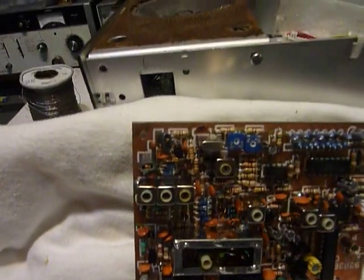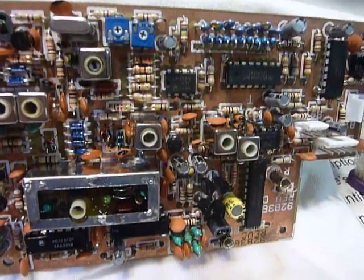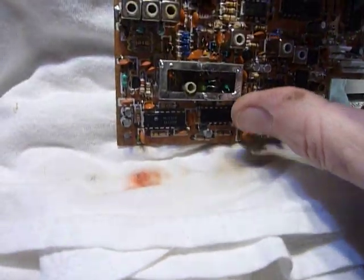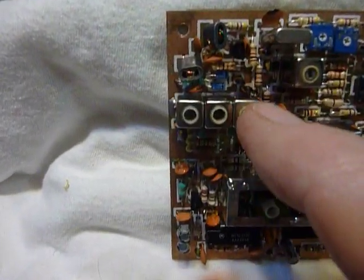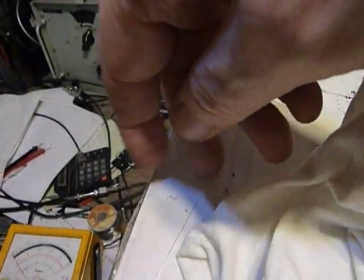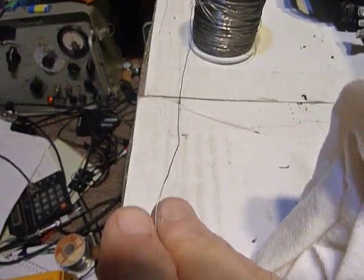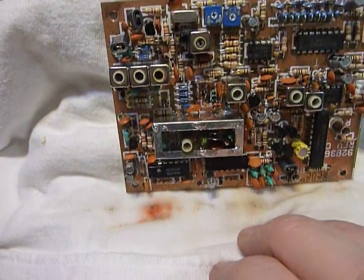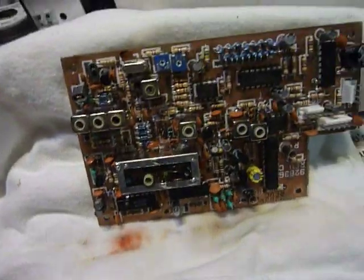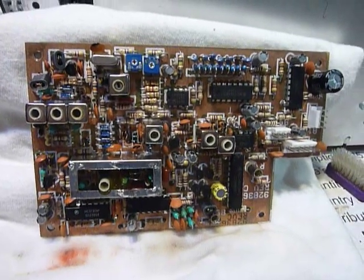So that's it. I am going to do the rest of this board too, just not right now — I'll do it after I get done with this video. I was just showing you how to clean the board. I had re-soldered all the connections underneath these little transformers using a very small soldering iron and 15-thousandth diameter solder. That solder was given to me — the people that bought it thought it was too small, but when you're working on little bitty things and just want to add a little bit of solder, it's perfect. That's part two of repairing the TenTec Omni 6 Plus. 73s and good DX.